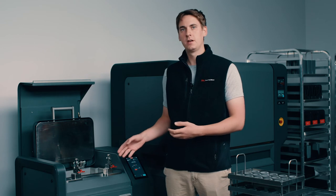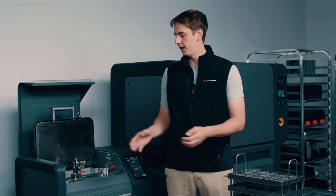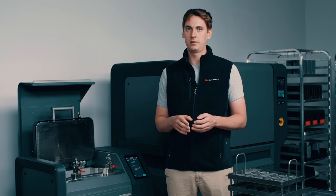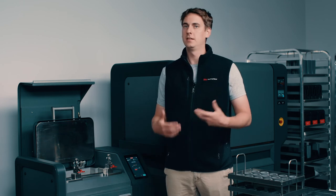So now we're over here with our debinder. Fabricate has already automatically calculated all of the debind times, as well as told us exactly where to place our parts on the trays. This means all that's left to do is place our tray into the debinding tank. You may notice that I'm not wearing any personal protective equipment. The Desktop Metal Studio debinder is the world's only office-friendly solvent debinder. This means the parts go into the debinder dry, and they come out of the debinder dry. The process chamber is completely sealed, meaning I'm never exposed to any chemicals while we're debinding our parts. In addition, the system does not require any extra ventilation or require you to clean out any of that gunky leftover binder. Instead, the fluid is distilled, recycled, and all that binder that's removed from your parts is simply stored in a canister below. When the canister is full, our UI will prompt us and we'll simply just replace it. Let's get these parts debinding.